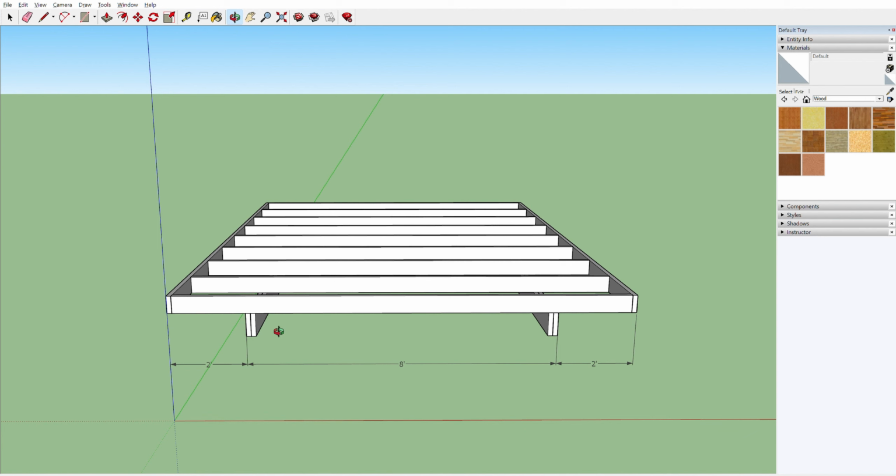I was taught in architecture school that the cantilever could be 1/2 of the distance of the joist behind the cantilever. But that also depends on several other factors.